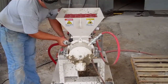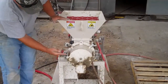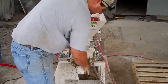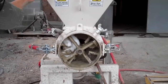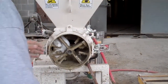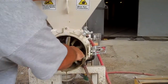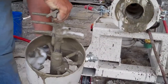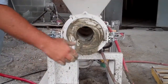The first thing we're going to do is attach the foam and attach the water. We're going to pop the face off by taking these clamps off. This is what we need to clean out — this is the basic mix chamber. We'll need to rotate this and take this whole assembly out of the mixer. These components will be washed off and we'll simply rake this material off. When we clean it up, make sure we've got a good clean face right here to make sure our parts go back on correctly.